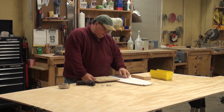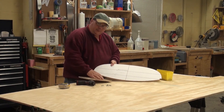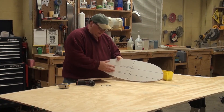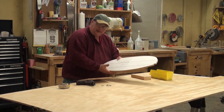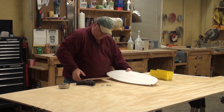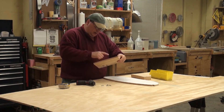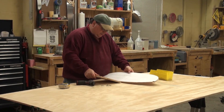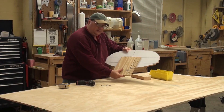I've got my screws, screw gun, and my 10-inch tab — again, measure, measure, measure. The design water line tells me I need to be 10 inches up off the strong back. It may not be intuitive, but you build your boat upside down, so the tab needs to go from the form toward what would normally be the deck of the kayak, which will be down toward the strong back. I've got this tab with center lines drawn on both sides, which lets me position it accurately.